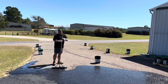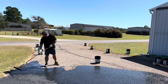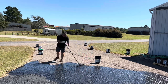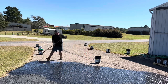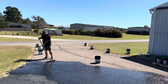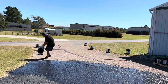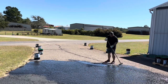I started with rubber gloves to keep the sealer off my hands, but after so much squeegee work I switched to cheap leather gloves to better protect against blisters. The technique is to get a pile of sealer and work it back and forth, then squeegee off the excess so you don't get too thick a coat. If it's too thick it will crack, doesn't look as good, and won't dry properly depending on temperature.